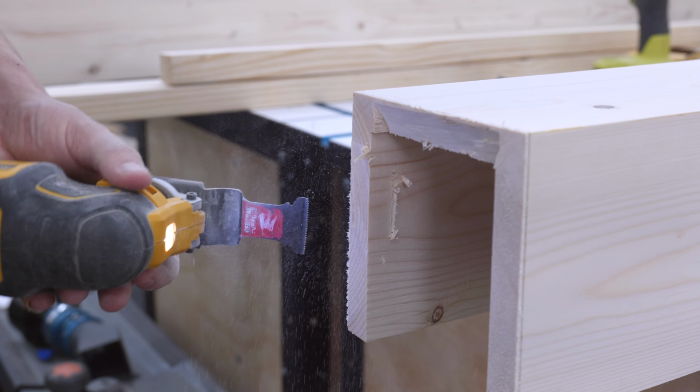And it's not actually necessary, but it's going to be really helpful in our case because this house is pretty old and the sheetrock people in general sometimes can be iffy, but it's just a disaster in there as far as the levels being the same as the sheetrock and the door casings and sheetrock panel to sheetrock panel. It's just kind of a disaster. So if we don't hook these together and keep them tight before we install them, there's a high likelihood that when we install them, they could get forced kind of out of plane, and that's going to look bad.